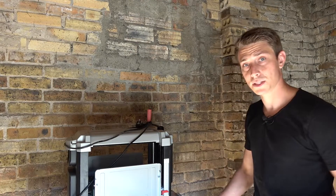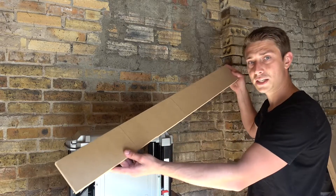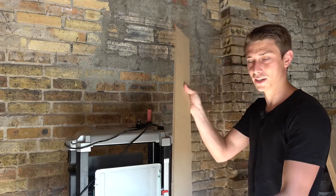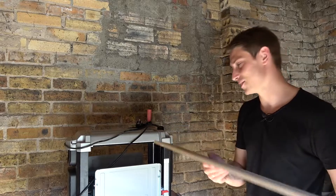Now all you really need for planing thin pieces of wood is just a scrap piece of wood you have lying around — we're going to turn it into a nice and easy-to-build jig. Here I have a piece of MDF lying around which I use most of the time as a fence, because for my jigsaw I need a fence to get perfectly straight cuts. You can also find a link to that video down in the description.